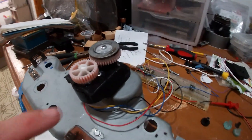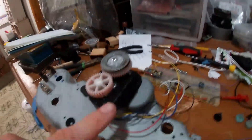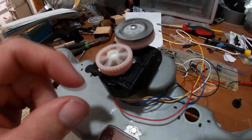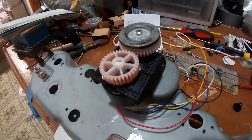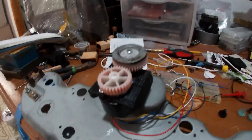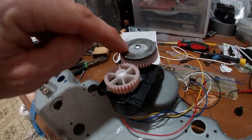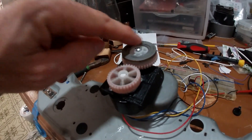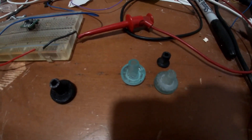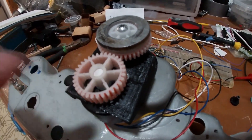Here's a better look at the back of the dash. I designed this bracket in SOLIDWORKS and 3D printed it. These gears were pulled out of a home printer that was torn apart years ago. I was able to come up with a gear ratio that works well. I added a washer to give the system a little more mass, which helps stabilize everything a little bit better.